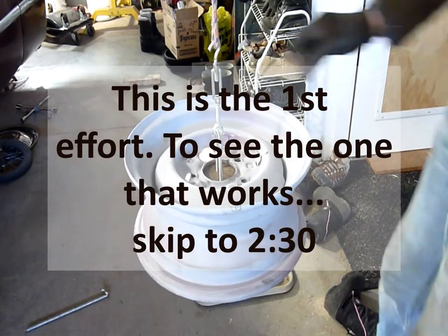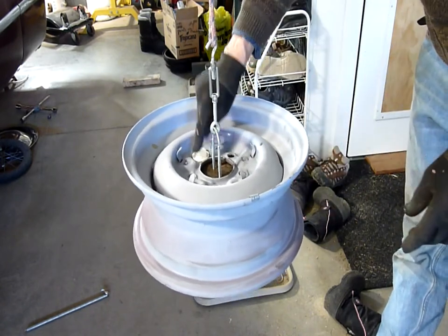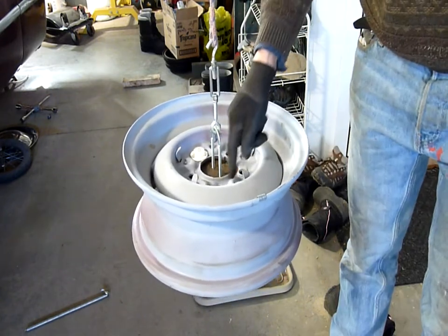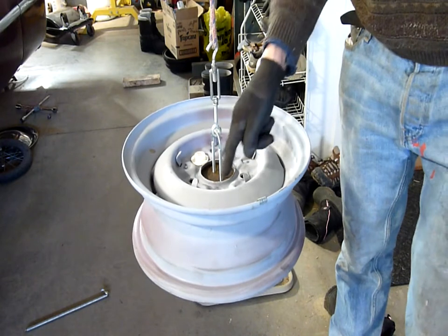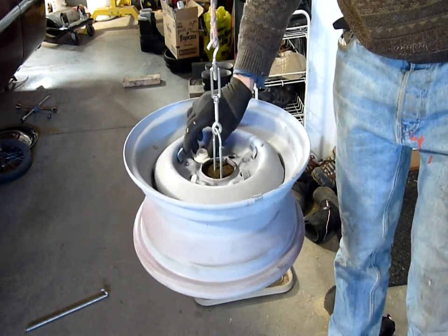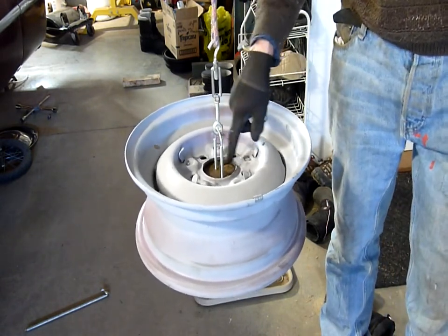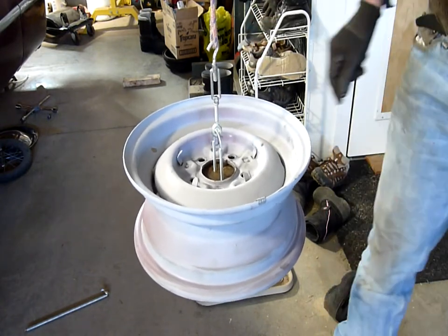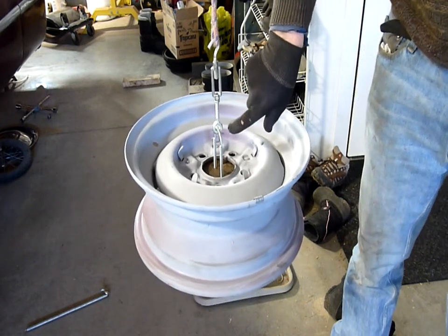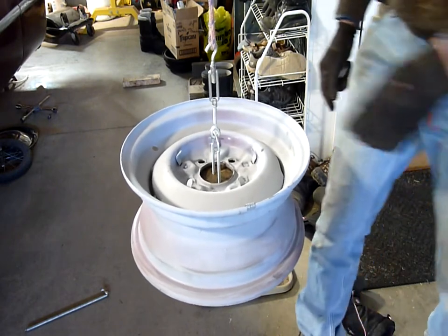Revision two. You'll have to get a smaller RV bubble level — this one touches the slopes in the rim so it's hard to get it in the exact right spot. I took the round piece of steel so you can sight it through the lug holes and make sure it's exactly centered. Then I centered these holes equidistant, put this U-bolt on — it's new so it's got a nice smooth surface inside, not like the other one — and likewise this turnbuckle. Put a little grease on them so it should be self-centering.